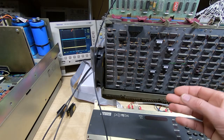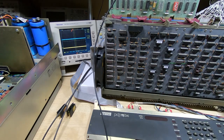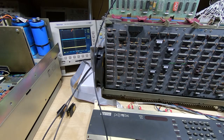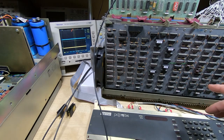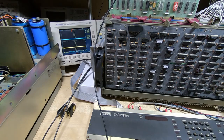What would happen if I tried to read a disc using a normal boot process was the drive would start clunking away and it appeared to read the first part of the first sector, but then the PDP would hang. If I tried to halt the PDP I'd get a bus error, so it was obviously stuck part way through a bus cycle.